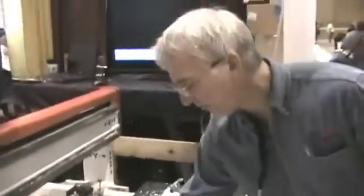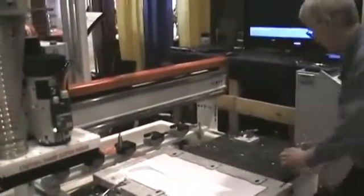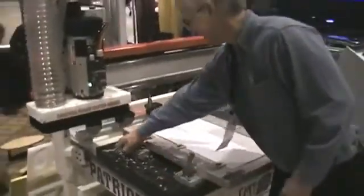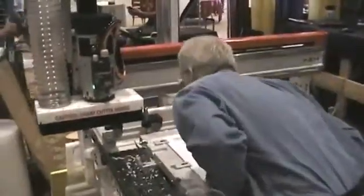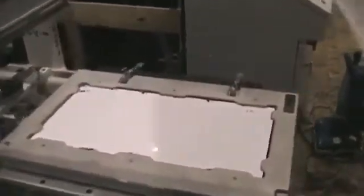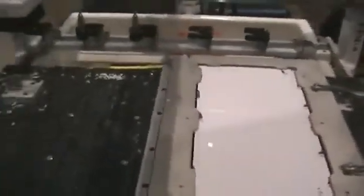You can see the kind of finish that we got on the part — nice finish. The machine has gone to an M00 position so I can flip the fixture. Now we lift the handles to the other side so we can flip our fixture over, secure it, make sure our other handles are down, and hit cycle start to machine the second side — the bottom of our part.